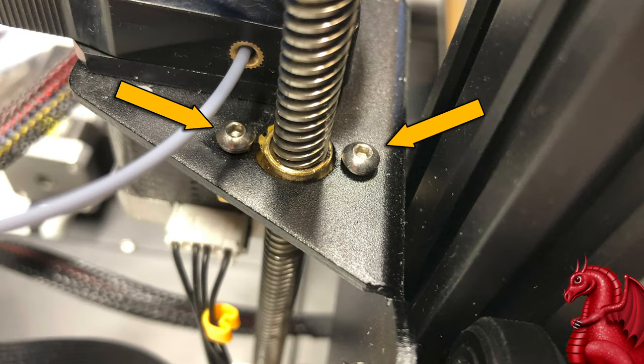and see if that resolves it. So to get started here, the first thing, if you're experiencing this, I want you to do is make sure that the two screws that attach the brass coupler for the Z-axis screw to the X-axis bracket, tighten these down fully and then loosen them each 2 full turns. You want them loose. What this will do is allow that coupler to shift as necessary to accommodate slight variations in that Z-axis screw mounting. If it's tilted a little bit, or if there's a little bit of bend to the screw, it will compensate for that